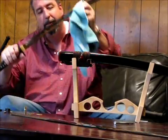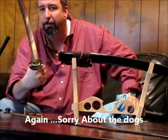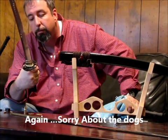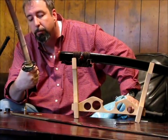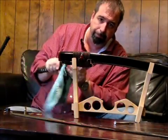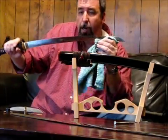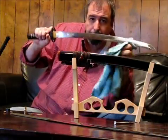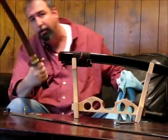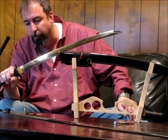It doesn't bend like a European sword because geometry makes it very stiff. This is a nice through hardened sword, which still makes it very good, nice and hard enough on the edge to hold a good edge, but is much springier and less prone to bending as a differentially hardened sword would. So it makes it a good choice for today's cutter who wants a tougher sword.